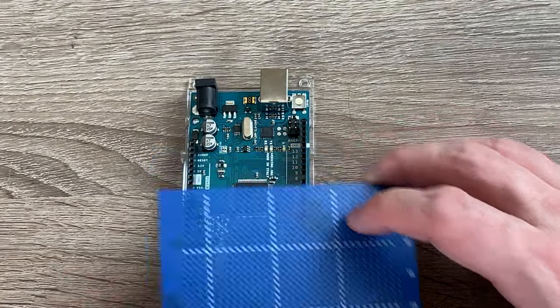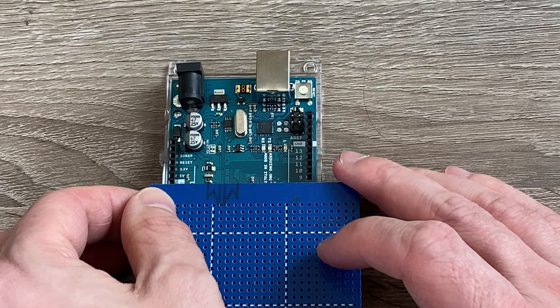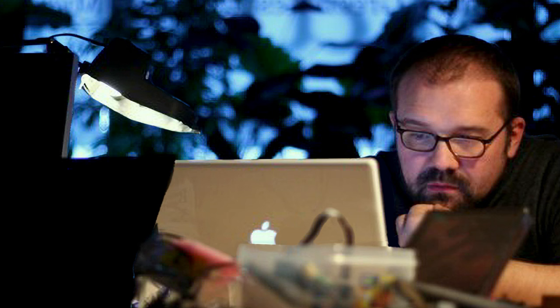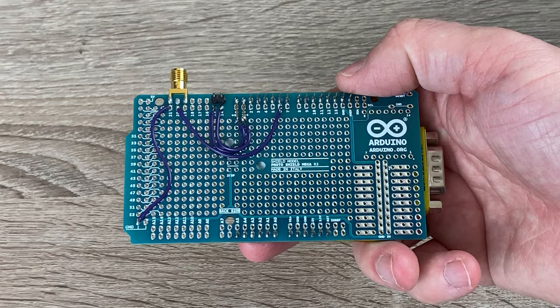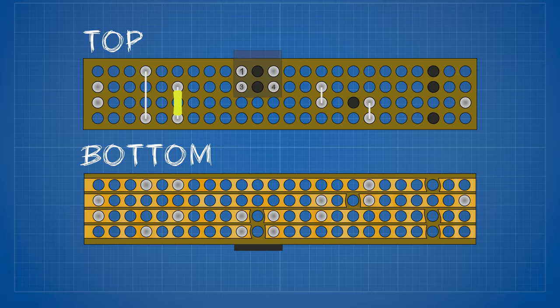If you're making something more complicated and need a lot more connections to the Arduino, then using stripboard is actually a bit of a pain as the headers don't line up. And if you believe the legend, it's because working late one night on the design to get it sent off for the PCBs to be printed, the headers were accidentally shifted on the Gerber file, and since then they've had to live with it for backwards compatibility — it's also a convenient way to sell official prototype boards. But you can get offset header pins so there are some workarounds. For my board I'm going to plug it directly into the 5V and ground on one side, and pin 8 on the other side, so with just 3 pins it's still easy enough to fit.